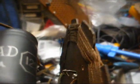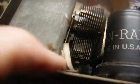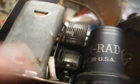Alright, IF transformer number 2 is done and soldered and back in place. Now it's time to do number 1, which will be basically the same as number 2 with the exception of this one. Not only do they have it clipped to the chassis here, they also have the can soldered there to the chassis to ensure a good ground connection.